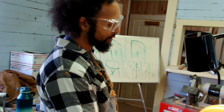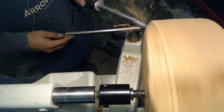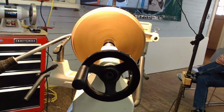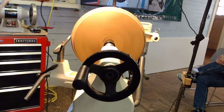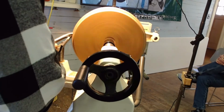This would be considered a left-handed cut. One where I'm starting here, right there. So that's with the left hand on the top of the tool near the ferrule of the tool. I don't want to start all the way back here. I do want to have one point of contact with the forefinger on the tool itself, and just below right there. The right hand really is just there for support. I like to cut both left and right-handed.